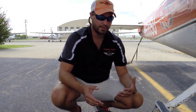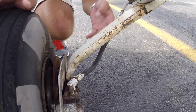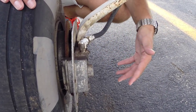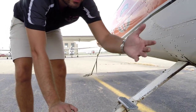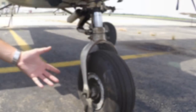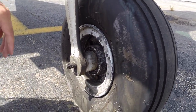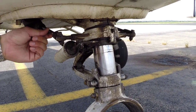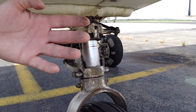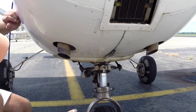Another important part is the wheels — we want to check those and make sure there's a proper amount of tire inflation. We want to make sure everything is hooked up and linked up right. We'll check the cotter pin — there's one right there; it's not going to come off. We'll check the brake line to make sure it's secured with no leaks, because obviously a brake line leak is not a good thing. The rotor looks good and all the bolts are there. We'll check the front strut as well. The tire has proper inflation, both cotter pins in on each side, safety wired, strut and shock absorber looks good, and the steering linkages look good. Down here we can also check the muffler — make sure nothing is blocking it and air can flow freely.